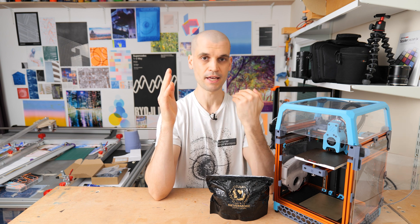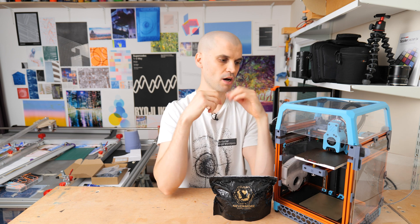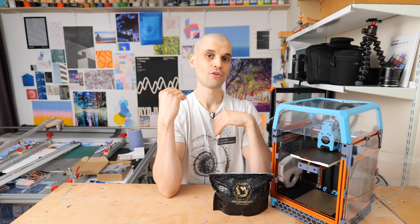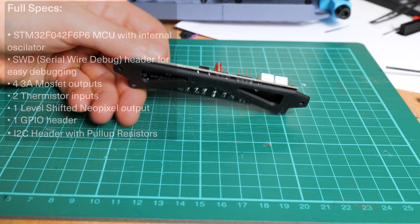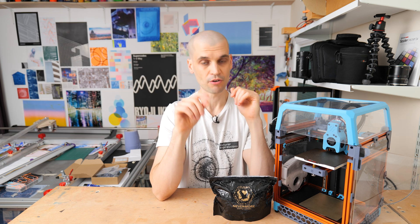The second option is to use a fan pin on your controller board. On the Voron 0.1 with the SKR Mini v2 or v3, there are only two fan ports already in use for the hotend fan and side blower fans, so there's no spare slot. You could upgrade to a board with three fan ports, but that means rewiring everything. The third option - what most people recommended - is to get a Klipper expander board. You install it in the back and it adds four MOSFET-powered outputs, an LED output, and options for filament sensors.